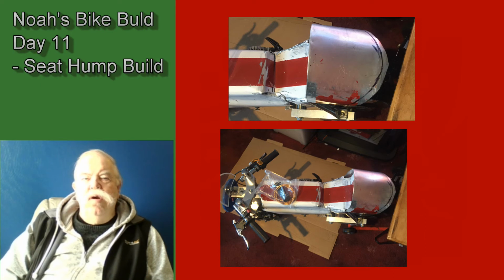All I had to do now was create the peak. So I loosely drew the curve of the peak, left a bit of space around this drawn shape because I like to fold the edge back on itself to create not quite a rolled edge, but certainly a safety edge, because hands might touch this area and I don't want it to become a cutting hazard.